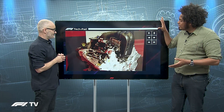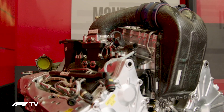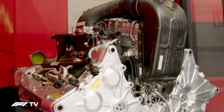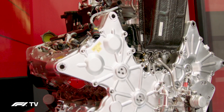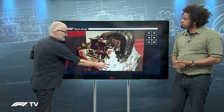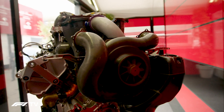Looking at the engine as an overall part, there's something I'm used to seeing on all racing engines — the current V6s, the old V10s, the V8s: where's the oil tank? Normally it would be sitting out the front of the block in a little recess at the back of the monocoque, but with this design of intercooler there's no space for it. This encapsulates some of the clever thinking Ferrari put into the initial design — very much following what Red Bull had been doing with Renault engine packaging. They wanted as clean a front to the engine as possible, with as little encroaching into the fuel tank area, so you could move the whole package forwards for that super-slim Coke bottle design. So the oil tank is actually sitting in the carbon fibre at the back, amongst that hot turbine within the carbon fibre gearbox case — a packaging nightmare.